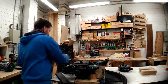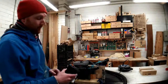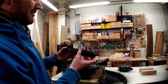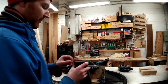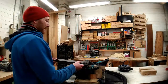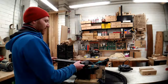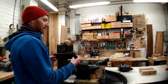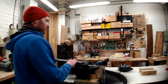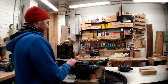Okay, got all the safety gear off there. And you see, got a pretty tidy edge there. Now, obviously, I haven't actually done this for a while, I haven't set this jig up for ages. Again, if you're working with a very long piece like this, it's not actually ideal. You're probably going to create a little bit of leverage here. And obviously, there's no AI built into this, so it'll dip and it'll cut your edge here, so you've got to make sure you keep it kind of level at all times. Long pieces like this are not ideal.